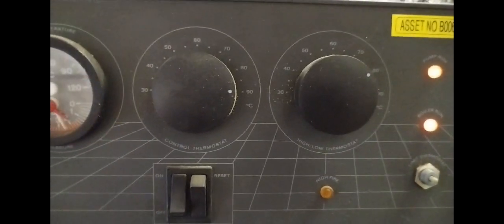So I continued checking the basics, seeing if there was gas to the appliance. It sounded as though there was gas. One of the appliances had a pilot light on, but for some reason it was failing to light. And then in the end, I pulled out one of the burners, washed them down, and changed the detection lead, also the spark. Swapped around some bits from the burner bar on the left, because you can just use the leads and so on, and the pilot assembly if you swap around the left burner. So there was an obsolete boiler there, which I used, cleaned down the left burner, and then lo and behold, the boiler came on and started lighting consecutively rather than locking out completely.